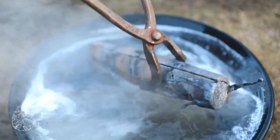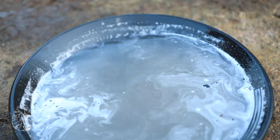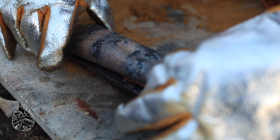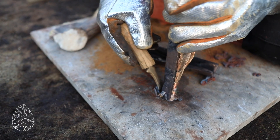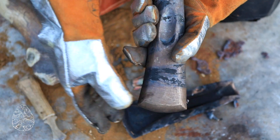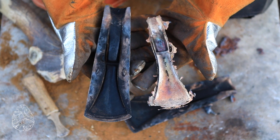As far as I'm aware, no one has actually tried casting a pallstave axe into a copper alloy mould before — this might be the first time it's been done in around 3,000 years. What I'm finding as I go through the process are little tricks, fine details, and the way I'm having to use certain tools to open it, which might leave marks that could correlate with ancient examples. As I keep using these moulds I'll hopefully learn more about how they deteriorate, the temperatures needed, and how to improve the process, because although it's a good cast, there's quite a significant heavy flash — this sort of frill — around the outside, and with more experience I hope to reduce that.